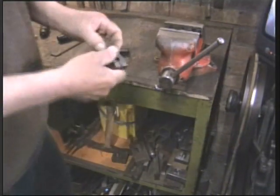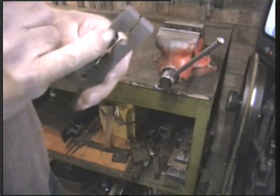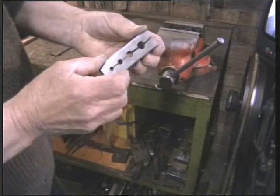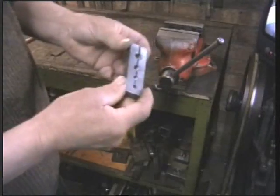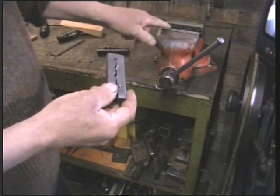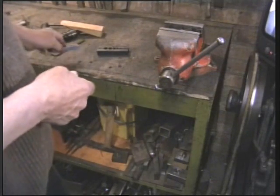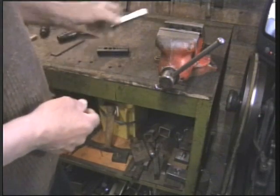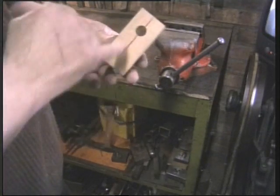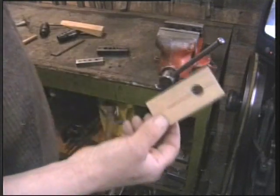I have made them. Here's one I've made with threads in, Whitworth threads in this case. You can see the principle, it's just simply squeezed up, pivot points here. It allows me to hold bolts if I'm working on the heads or studding without damaging the threads in the vise. It's far better than just soft jaws. If you haven't got the size you want, as a temporary measure, you can use a piece of wood. And here I've drilled a 1/2 inch hole, slightly over 1/2 inch, in a piece of hardwood and put a slit through it. Well, you can see the principle, it's dead easy.